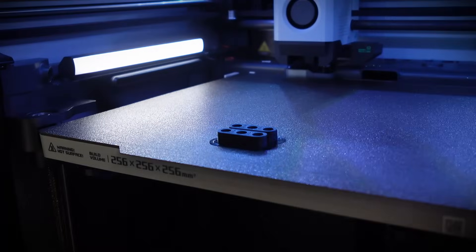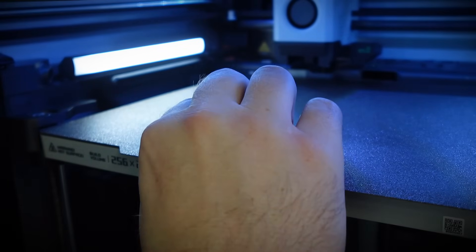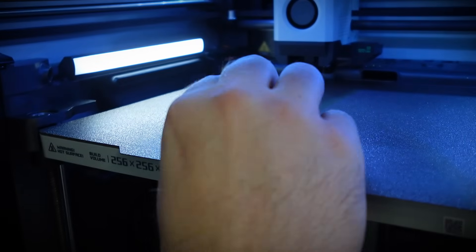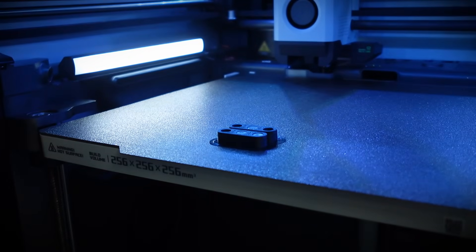Our print has hit our pause point in the G-code and it's time to put our magnets in. We need to make sure the polarity is the right way — this is why we marked them. Because this is a test print, I tried the 6.1mm diameter and it was too difficult, so I went straight to the 6.2mm which needed a little more pressure but I was still able to push it in. The 6.3mm just dropped in but there was really nothing holding it in place. Keep in mind that I had to reverse which way the magnets were facing because when the two parts are brought together they need to attract each other.